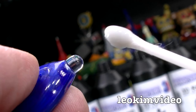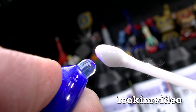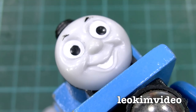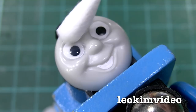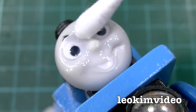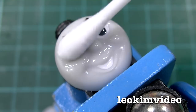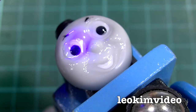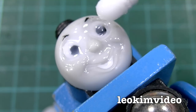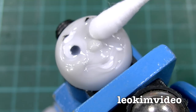I'll try and show you how this product smokes as it sets off with the UV light — look at that, smoking as it sets. So be a bit careful playing with this stuff. Just for fun, I've got some white resin here and I'll try and do a Slender Man Thomas face. It's funny how you muck around with things and then strange things happen. One of the things I learned is if you try to set off too much of this stuff, you get strange bubbles, so it's definitely a layer-by-layer thing.